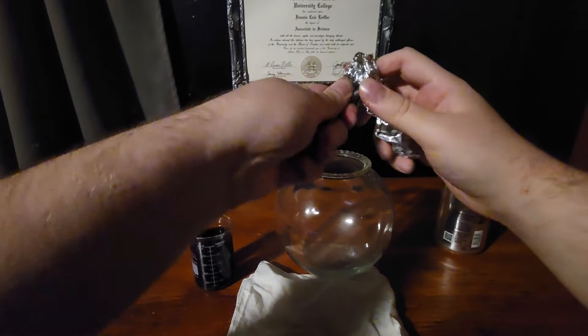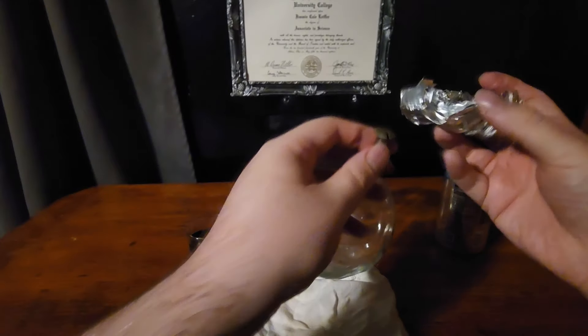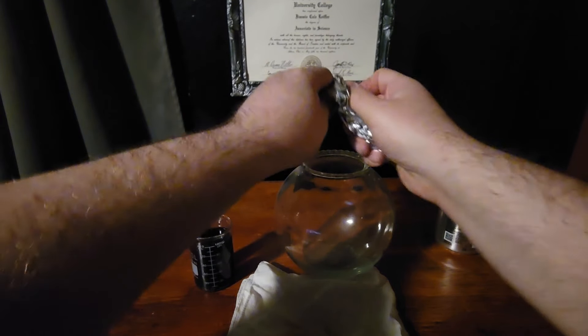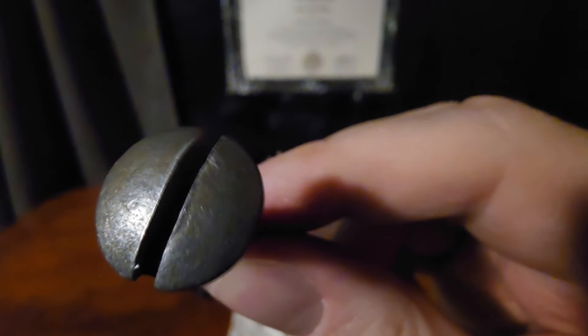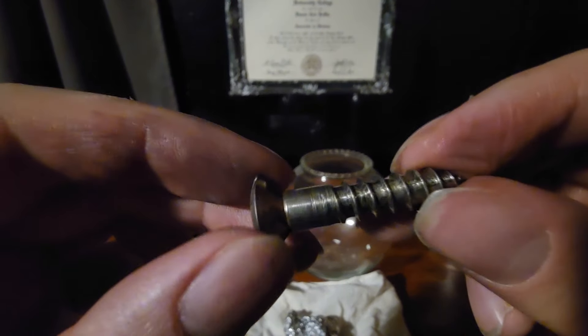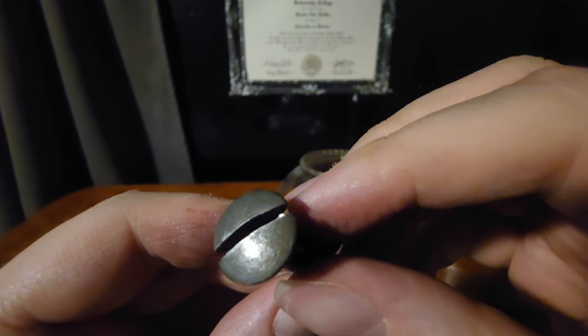The longer you let it soak, the more it will help you get the rust off. Also, if you use something a little sturdier like steel wool, you'll probably have a better time cleaning off the head than with just aluminum foil — but this will work as well, it just takes more time and effort. Here's the screw all cleaned up — see how shiny it is? A little bit of imperfections remain, but the small amount of iron phosphate left behind can actually prevent future rust damage, as long as you keep it clean going forward. It can do a lot in a relatively short amount of time, and that's one of the things I find impressive about this method.